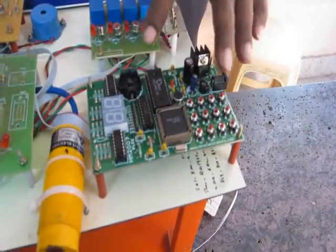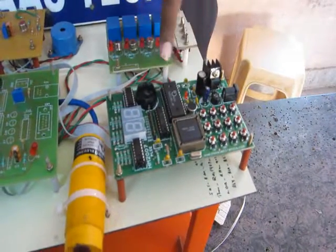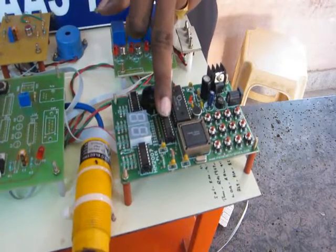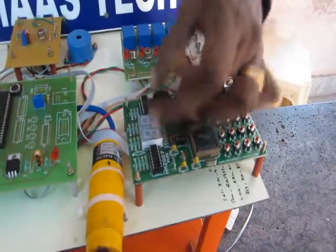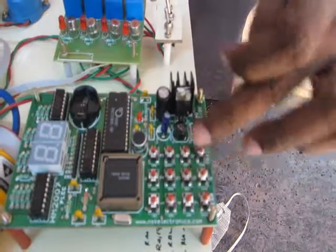This is the voice control board HM2007. This includes the 6264 RAM IC, 74LS373 latch with flip-flop, 74LS47 BCD-to-7-segment decoder, and 7-segment display. This is the 5-volt power supply. This is the key switch — totally 12 key switches.